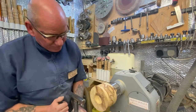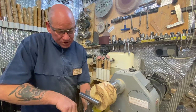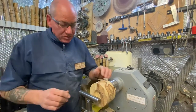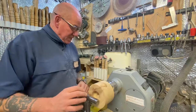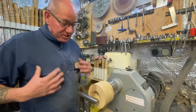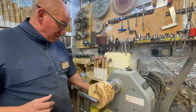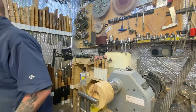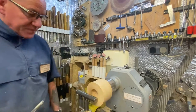I like to turn a little bit fast — I don't think I'm dangerous, I just turn fast. As long as your wood's mounted right it doesn't matter if the lathe is shaking a bit. As long as it doesn't come off, the lathe isn't going anywhere. This little bowl would be turning at about two-and-a-half thousand RPM. Right, I'll spin that up.